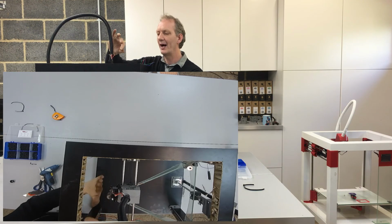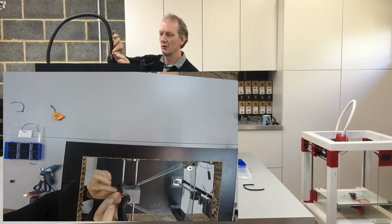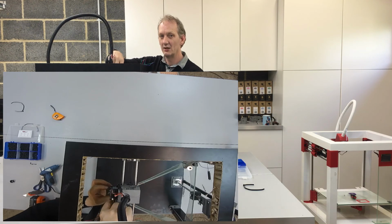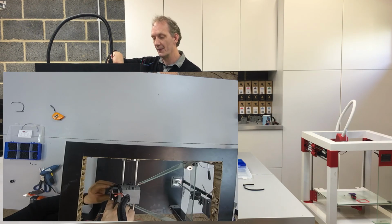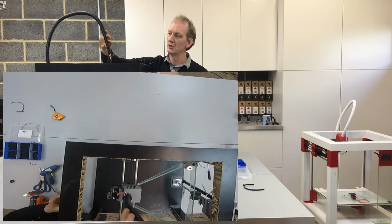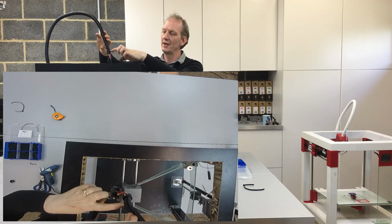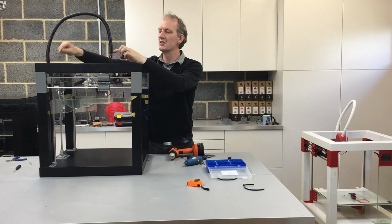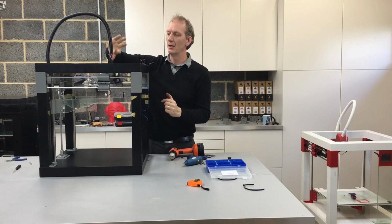The hope is then if I have got any problems with my hot end, I can just undo the connector, and then undo the front of the Titan, and that's easy access then for the hot end to come out of position, rather than having to keep going through all this. Obviously we will have a cut in the conduit around about here when we come to line the PTFE tube through, which is the feed tube for the filament coming up from the bottom.